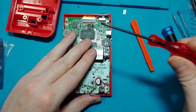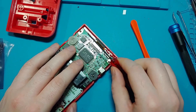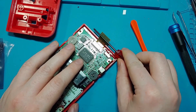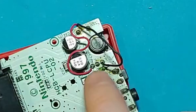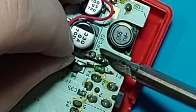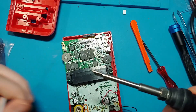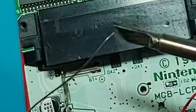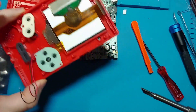I'm going to use just one of these screwdrivers that comes with every other kit to actually get this out of here, because that takes the stress off any one part of the cable — it spreads that stress out. You guys ever had your stress spread out? And if you're like me, you're also going to have to unsolder these two cables here. But if you don't have a backlight going, you're not going to have to worry about that.